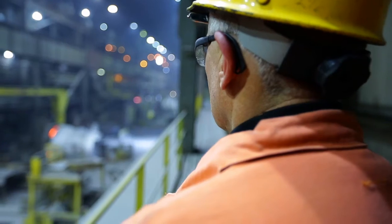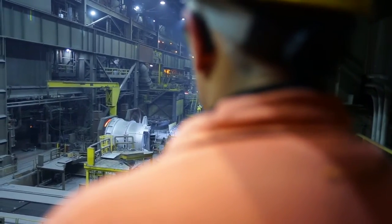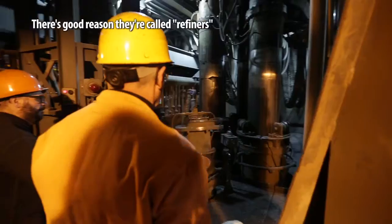Adding reheat is done with the electrodes. We have three 16-inch electrodes. Those produce 6 degrees per minute. So we know that if we need 30 degrees, we need 5 or 6 minutes of reheat to get that temperature back up.